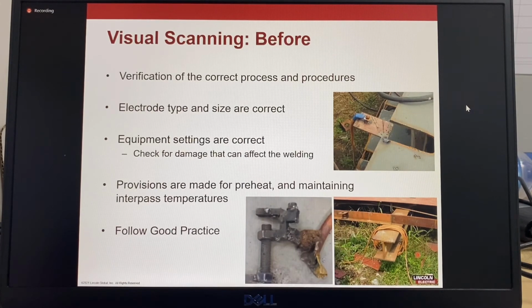This picture shows a welding cable wrapped around a steel beam. So anytime welding cables are coiled, they create an electromagnet, which causes loss of welding current. Depending on the length of the welding cable and what it is coiled around, it is possible to lose 80 amps when welding. The ammeter on the machine will have the correct reading, but the welder will be trying to weld with much lower amps that can cause slag inclusions with stick electrodes.